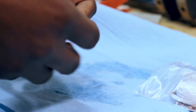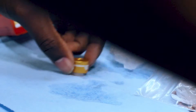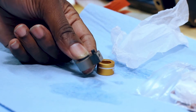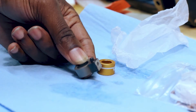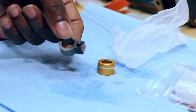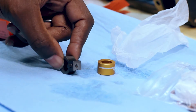The other thing I got are these little guys, and all they are are just little piston oil squirter delete spacers — whatever you want to call them. These are the original oil squirters. My first idea was just to cut the little spout off, weld it shut, and just reinstall these. The problem is that it's really difficult to weld metal that's been soaked in oil and heat cycled.